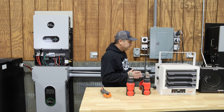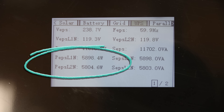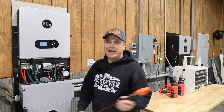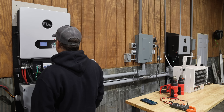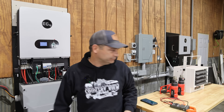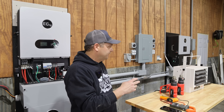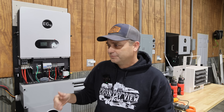My heaters have cooled back down but I'm kicking them back on. We're over 5,800 watts on both legs — almost 11,700 watts — with 47.7 amps on L2 and 49.3 amps on L1. We're about as maxed as we can get without making it switch to the grid. It ran the 12000 XP for about six minutes at 11,600 watts, just under maximum output — ran just fine, didn't switch to the grid. One of the heaters kicked off because it got too warm in here, otherwise it would have kept running. That proves it has pretty much a continuous output of 12,000 watts.